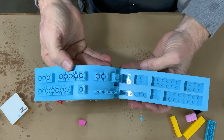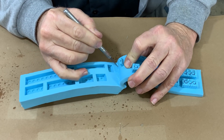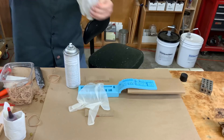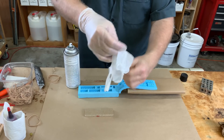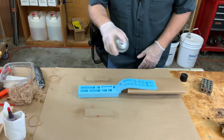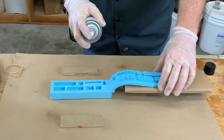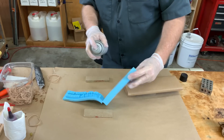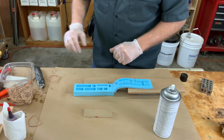The mold is absolutely flawless, but I need to cut the hinge now because it's a little close to this one mold. I definitely don't want to cut it free — I want to leave the two pieces of the mold attached — but that should give me enough clearance and fold back neatly. I should have gloves on because I might get resin on my hands doing things like this. Safety first. Let's get some ease release going. I'm going to put a light shot of ease release on these parts because they're really hard to release, spreading them open to give the lightest possible coat. I don't want them to be dimensionally different — these are the side pieces that hold our registration.